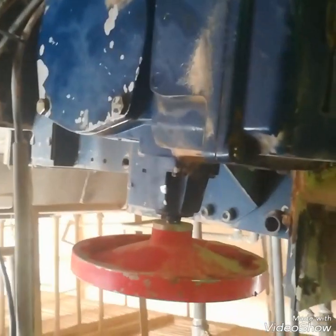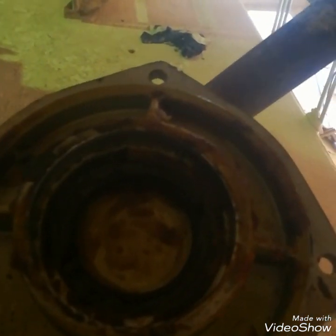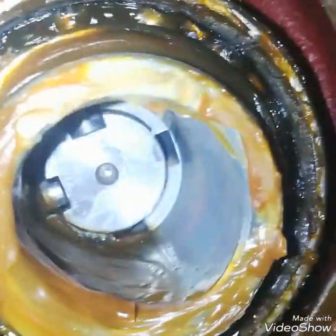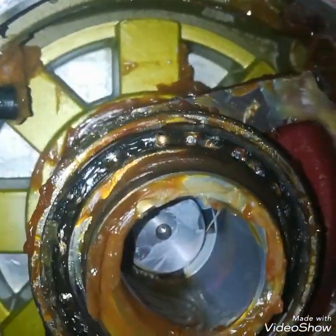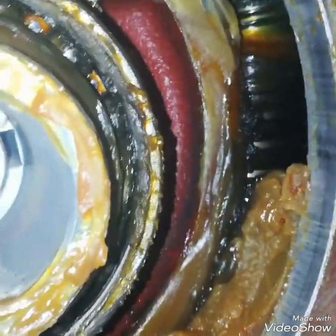Hello friends, how are you? This is a Bernard actuator — a motorized actuator creating an unusual sound. We will check what is the reason. I think the grease in the gearbox is not okay. I will remove these bolts and check the condition of the grease. As you can see, this is the bearing, and the grease is not okay — it's melted, it's converted into fluid.